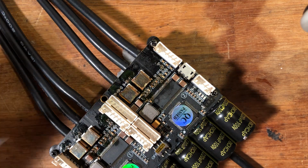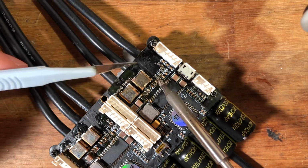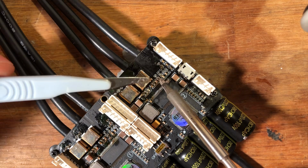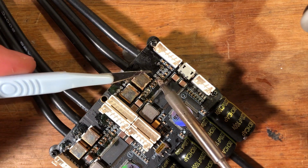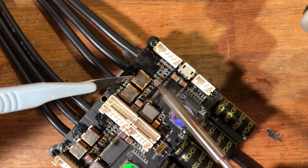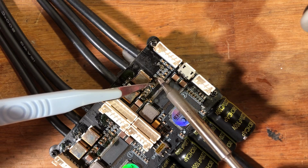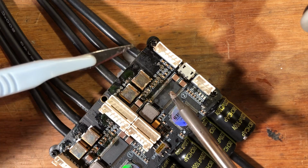Okay, a few other things. What happens if you happen to get some of the other components stuck to your soldering iron? That will happen a lot. What I would do is be prepared for it. First, you want to know that that's a big thing. If you stab the soldering iron and you lift up another component, try to get it off as soon as possible so it doesn't heat up too much.